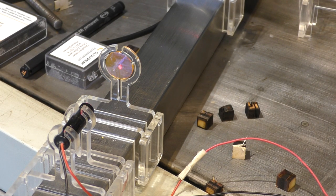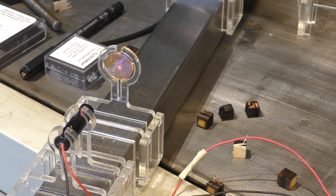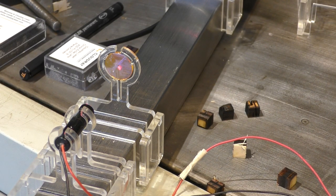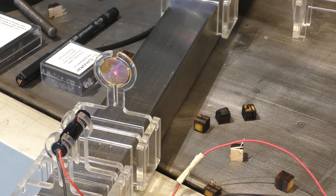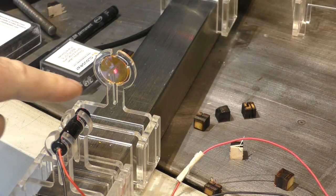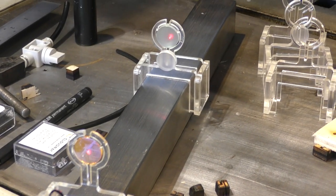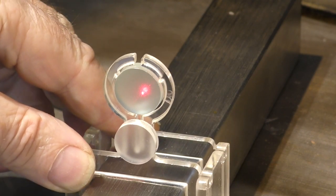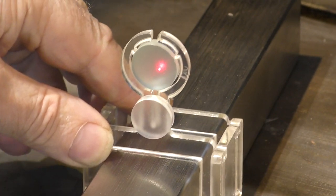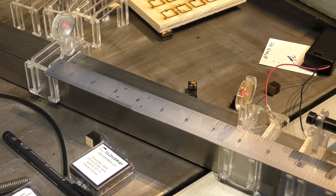We found this seven-and-a-half inch lens was working with a focus at nine inches, not seven and a half. So I decided to bring my little old bit of kit back into action with its red beam to check. With the red beam on this seven-and-a-half inch lens, because it's a very long focus lens it's going to be difficult to find exactly where the focal point is — but it's around about seven point six inches, so near enough seven and a half.